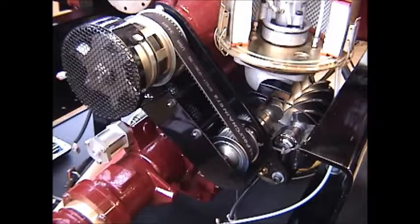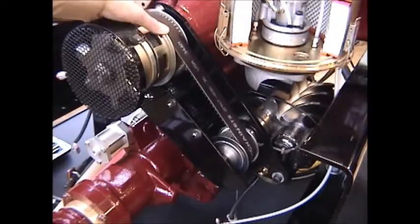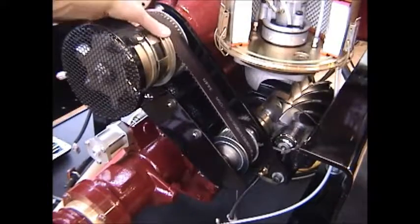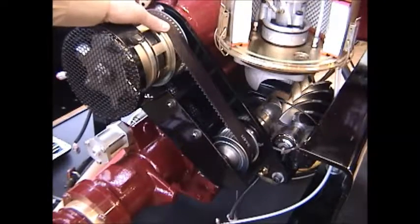Here you can see a cutaway cross-section of not only the air compressor rotors and the bearings that support the rotors, but also the clutch and belt drive pulley system that drives the air compressor. When the impeller shaft is rotating and the clutch is engaged, this entire mechanism will rotate and rotate the rotors in the air compressor to develop compressed air pressure.